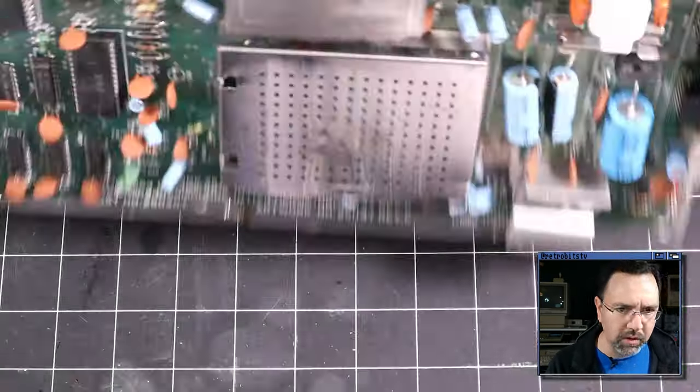As before, we've always got to rule out bad contacts on these sockets as a possibility, because if you remember the K-Pro episode, I had a bad disk controller, and I spent hours trying to figure out why the machine wasn't working properly. I disassembled the disk drive so many times, swapped them around, and really, it was just the legs on one of the chips that was in a socket that needed to be cleaned. So let's get that contact cleaner in there.